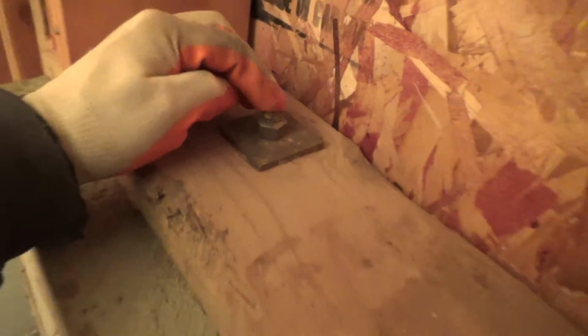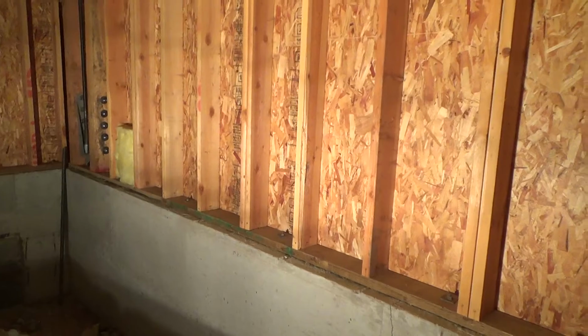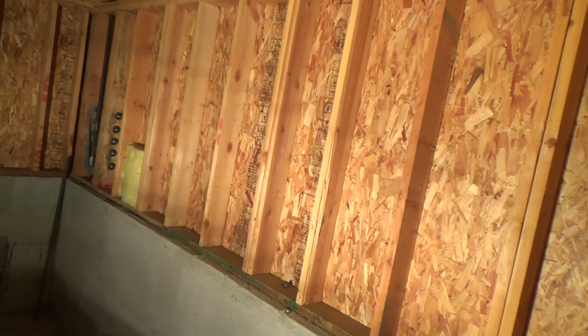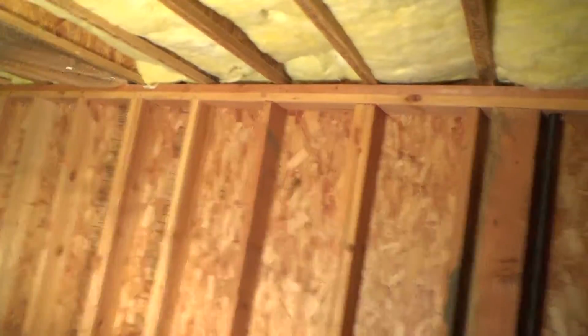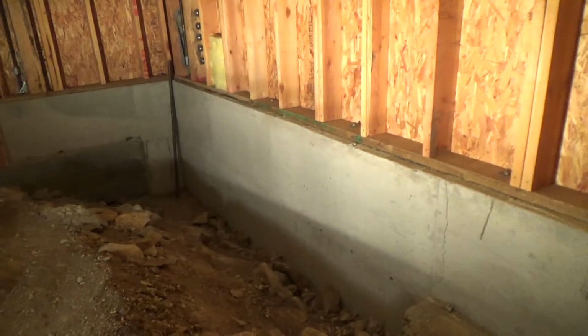These are foundation bolts. Okay, and because I can move around in here, I'm gonna check all the ones that are close enough where I don't have to get down on my hands and knees on my belly and all that kind of stuff. And they're stuck on the outside of here, and if these are loose, I'm gonna tighten them up. That might prevent the wall from sliding around, depending how loose they are, from having the stucco possibly crack with these things moving. It would just get everything down nice and tight if there's heavy winds, if there's an earthquake, who knows, anything like that. These are meant to be down and nice and tight.